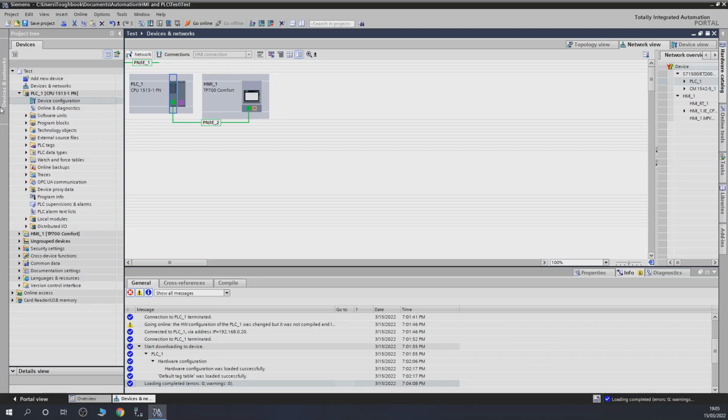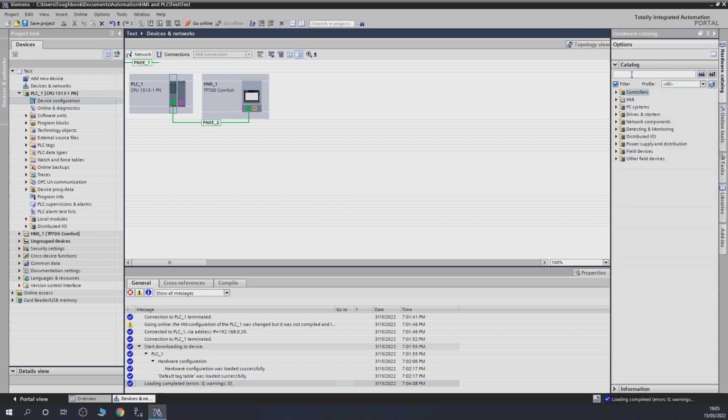This is a continuation of what we were doing in the last videos. So we go into network view and add that IO device into our system. In our network view, that is 155. Let's go 155. Just quickly search the catalog, and that's going to be 5AA01. So let's see if we can find it. Hopefully, it's not going to take too long. I know I just loaded my TIA Portal, so it might be a little bit slow. Come on.